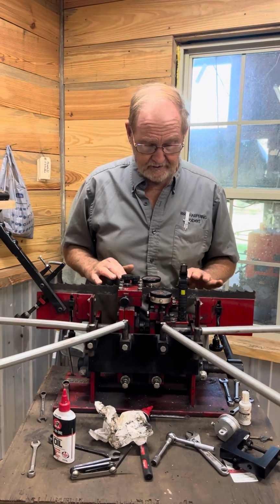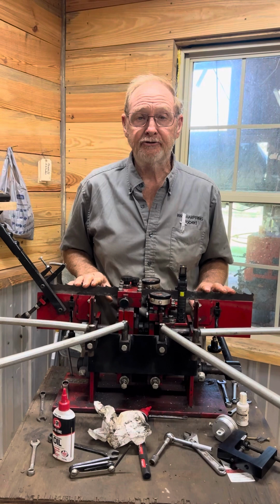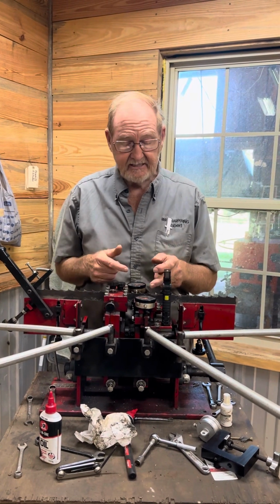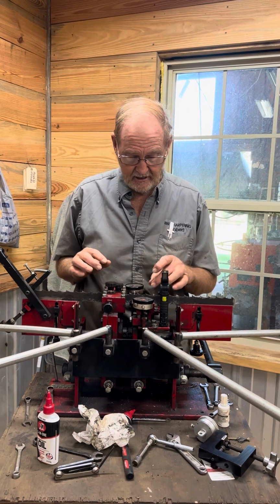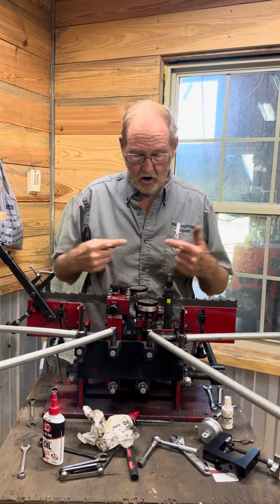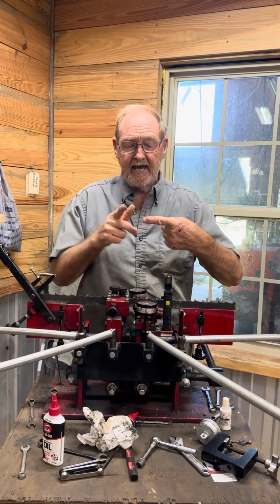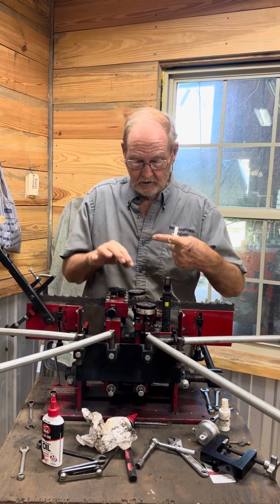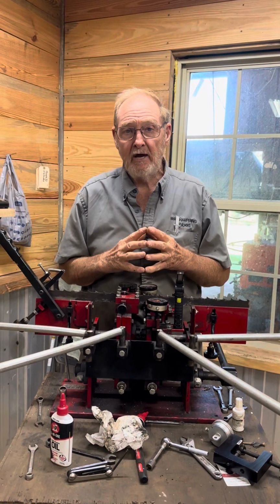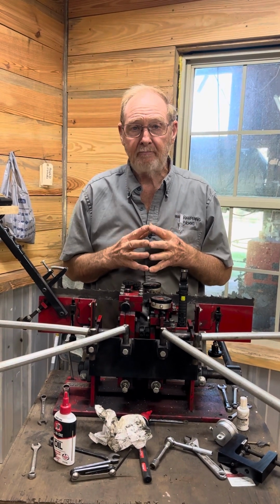So if any of you folks out there who are running one of these dual tooth cat claw setters and you're having an inconsistency with your indicators, check to make sure that the feet on your indicators are straight in and flat on the body of your blade. And maybe that will help you. I hope it does if you're having that problem.